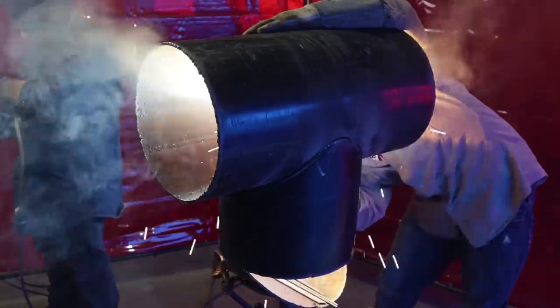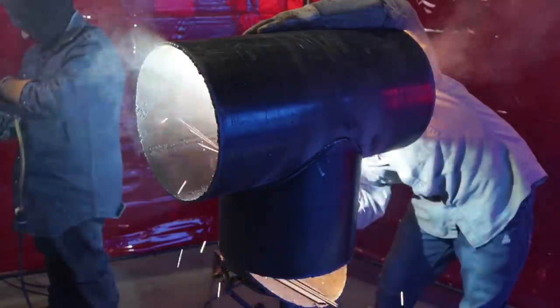Anything downhill, guys, you just want to drag it, okay? You don't want to do Christmas trees or whatever I taught you on the 3G open root uphill or anything like that. You just want to drag. Anything pipeline is dragging, or at least try, by the way. And that's the root pass.